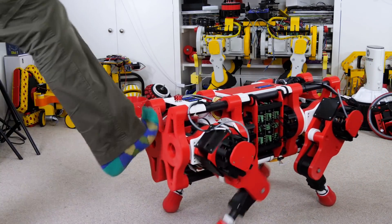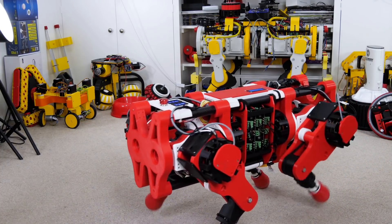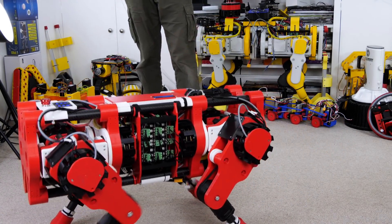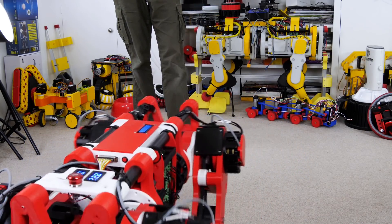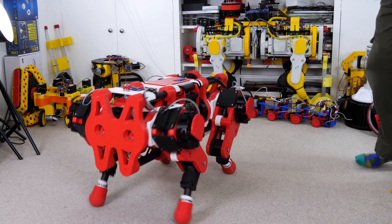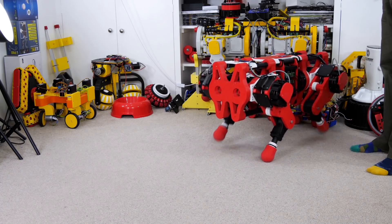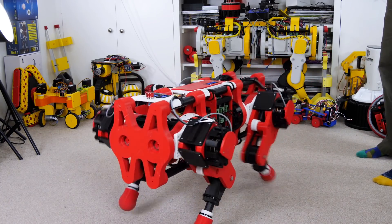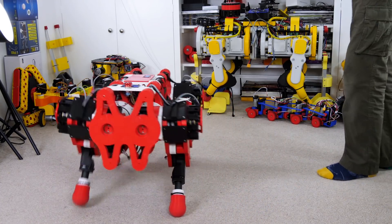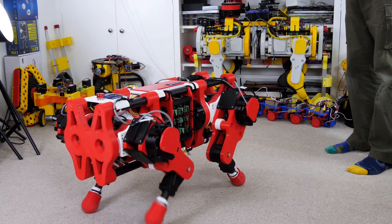The inherent natural spring in the legs helps a lot here — as I push it back it's still taking steps, the legs aren't totally rigid so they spring into position and absorb the load, along with those bits of dynamic stability from the IMU. It's actually quite resilient — even if I kick it quite hard and almost push it over, it still recovers without tipping, and this is much better than anything I've built before including OpenDog 2, which sometimes had its legs keel under itself while walking. I'm driving this manually at the moment with a remote just out of shot — it doesn't have any position hold, but we could use something like an Intel RealSense camera to scan the room and hold position.